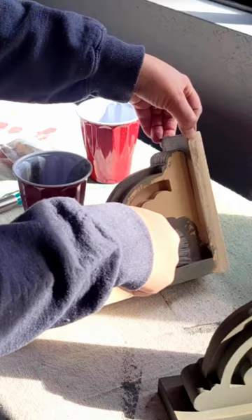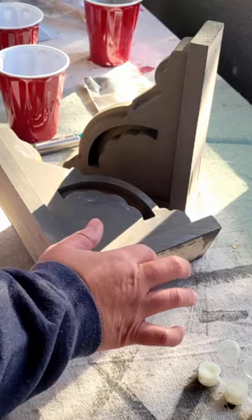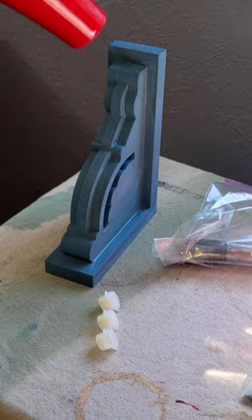I painted them a dark gray color, applied clear wax — but you could also use Vaseline — then painted over that with a blue color, then applied heat and wet distressed. This makes the paint crackle and chip to look old because I was using milk paint.